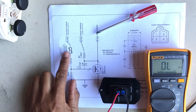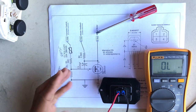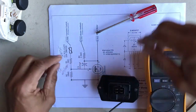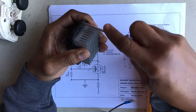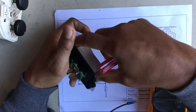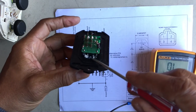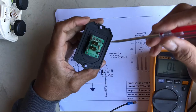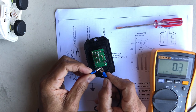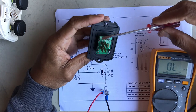Now checking the feedback branch — pins 4 and 3, the bottom pins. On the ohms setting we have 1.4k ohms, and there's a 1.5k here — within 5%, that's correct. Now checking where the signal comes in from the control unit through the voltage divider to the gate — that's pins 1 and 2, the top two pins. Pins 1 and 2 are open — that's not good. If this branch is open we'll never get a signal to turn on this transistor, so we can never turn on the motor. This is normally the thermal cutoff — it should read essentially 1 ohm or less. Measuring right across it — it's open. That's our problem.